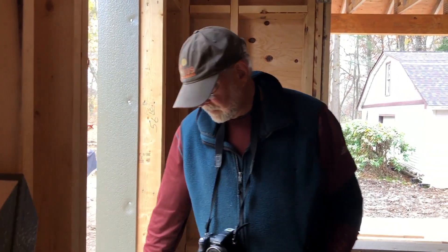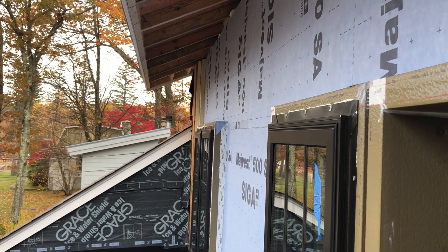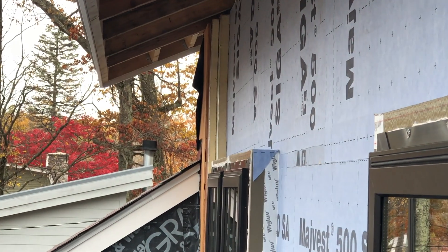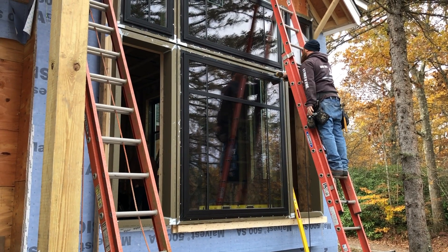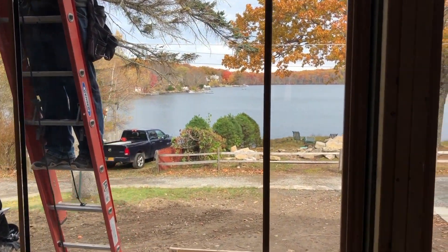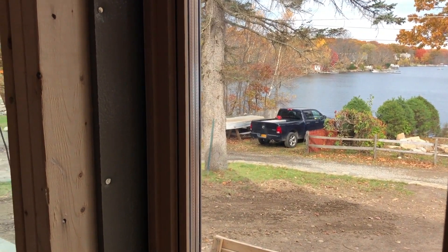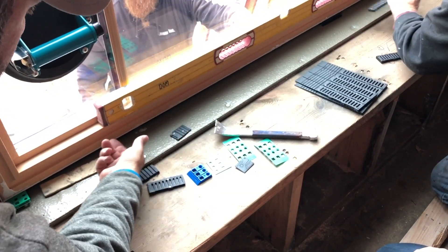I've been building these bucks, designing them out of wood and then cladding them with insulation to maintain continuous insulation. It's always an issue making it structural — getting your flange, dealing with extension straps on the window jambs to secure it, and dealing with thermal bridging. But as soon as I saw this product — the Thermobuck — I knew it solved all those issues. It makes it really easy to place the frame and screw it in the traditional way. As soon as you turn them in, it jumps up and then back down, and that part in there is foam.